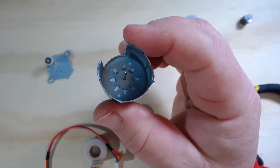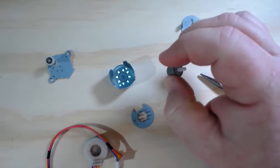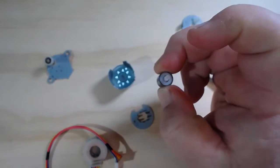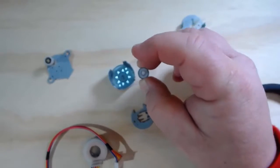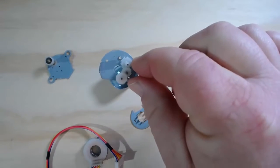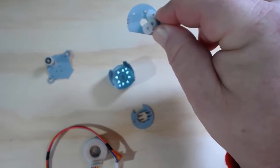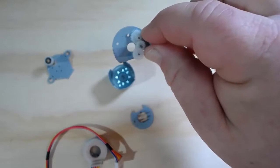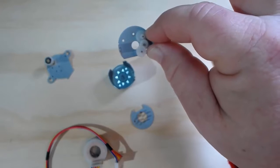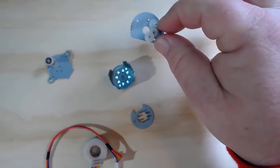That basically means that if I align the rotor with each one of those 32 teeth progressively, it would take 32 steps to bring that rotor one full rotation — with regular full-step driving. If I use half-step, that gets me 64 steps to a single revolution. Now, that's just the rotor within the teeth, not including the 1-to-64 step-down gears. Those give even finer resolution. With full stepping, that's 32 steps per revolution times 64, giving 2048 steps per revolution with the gears. If I go to half-stepping, I double that to 4096 steps per revolution. So you get very precise control at a very inexpensive price.